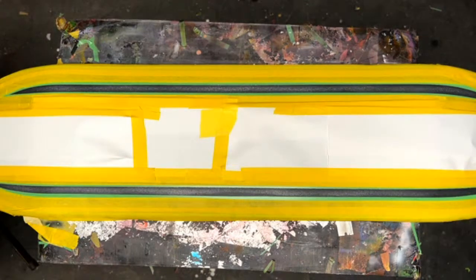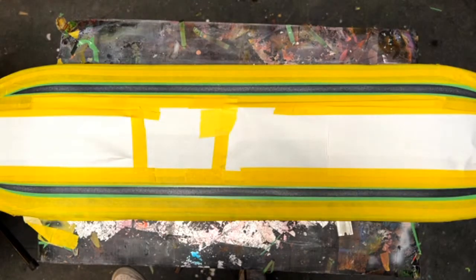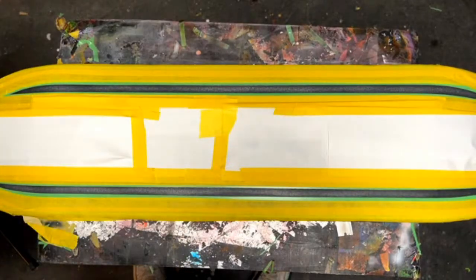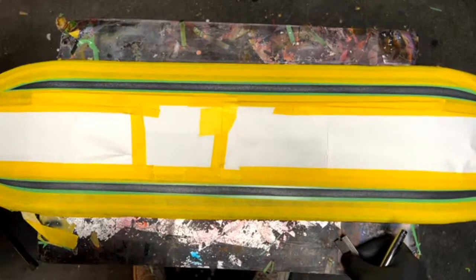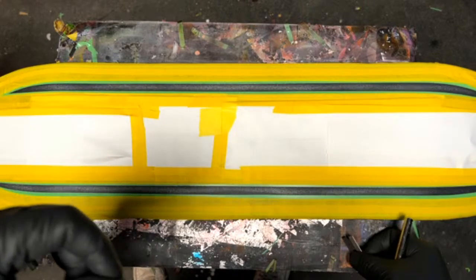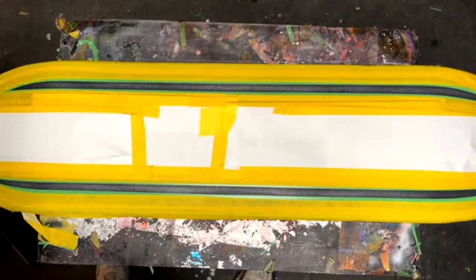Sophie said, fish eye normally happens due to wet air in the line. Would you agree? Yes, that could definitely happen. It could also happen if somebody sprayed WD-40 around your parts, even if it was 20 feet away, it could cause some severe problems. So be careful of that. But yeah, water in your lines will do it. Also, if you've got so much water in your lines, it could come out in a water chunk and splash onto your parts and cause little divots. It's not a fisheye, it's literally a divot, just a crater.